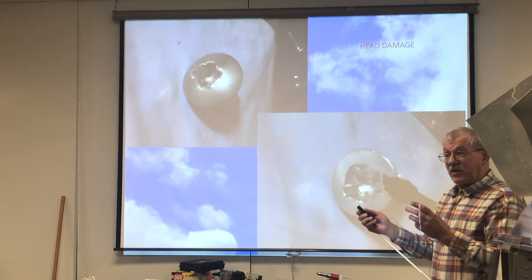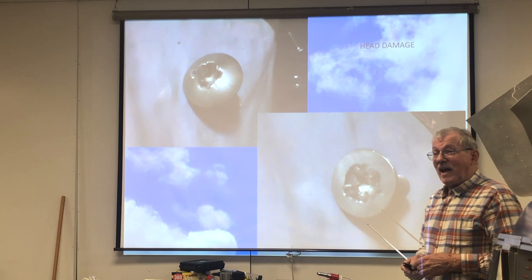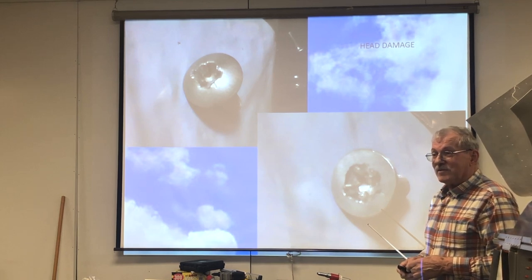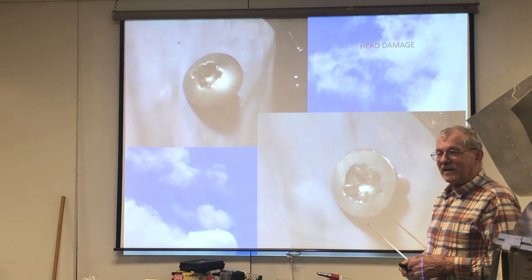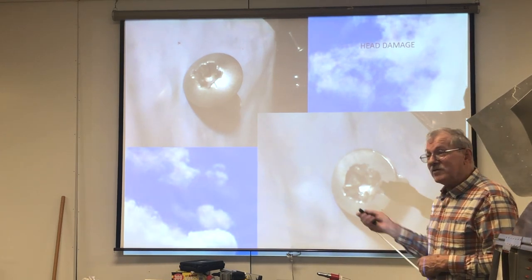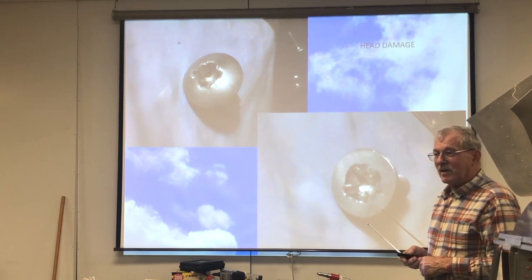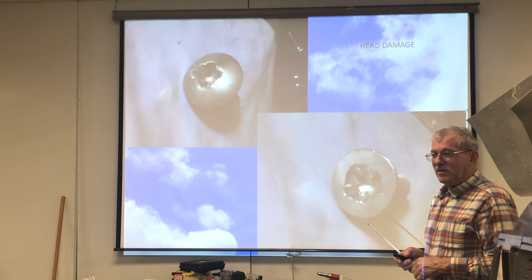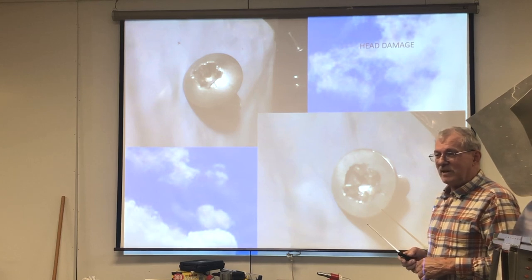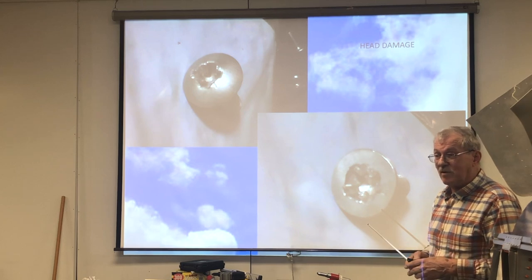Now, what's the cure for that? Well, plain cad-plated steel screws are not stainless, and so there's no galling that occurs between the nut plate or the tinnerman and the screw. And back when I was learning to work on airplanes, about the only time I had to use some harsh means of getting a screw out was when they were rusted in, because they'd been in so long.